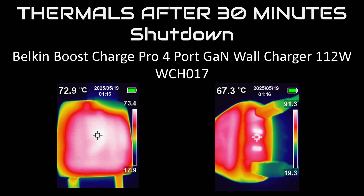Thermally, this charger got hot fast and didn't really have the surface area to get the heat out. It overheated and shut down at the rated load in 30 minutes. I tested the isolation — I didn't film it — it was fine. But after the poor thermal result, it's basically over. The efficiency tells you what you need to know.